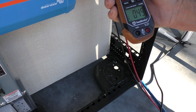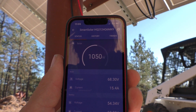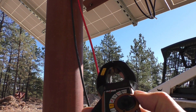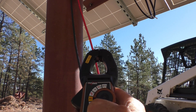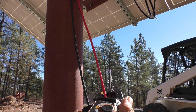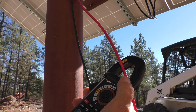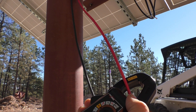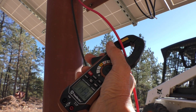It's a great troubleshooting tool to make sure that power is what you think it's going to be. The app for the charge controller is showing 15.4 amps coming out of the array at 68 volts. Setting the Southwire meter to amperage, mode to DC, and clamping it on the cable shows 15.7 amps, which is just what the app was saying — it's interesting that they're that close together. It will obviously vary depending on the sun. There are arrows on the clamp that you have to line up on your cable to get the most accurate reading.